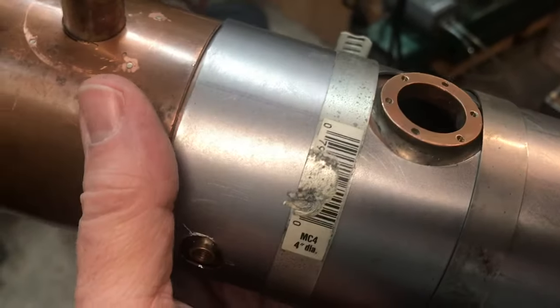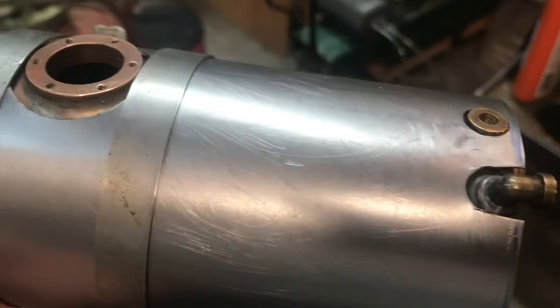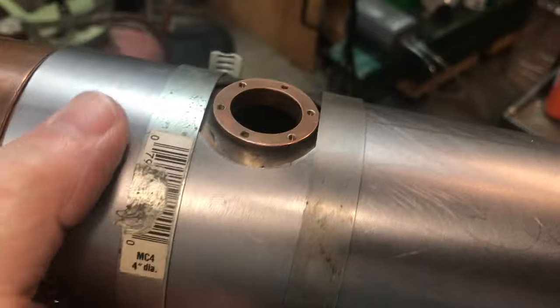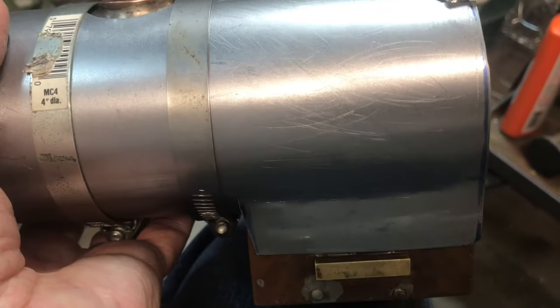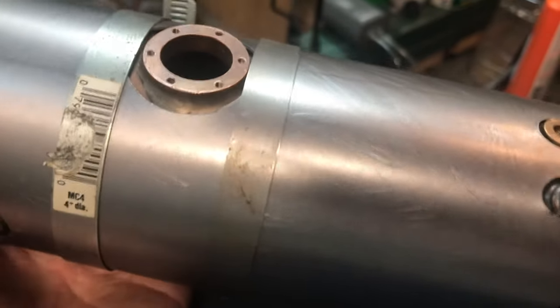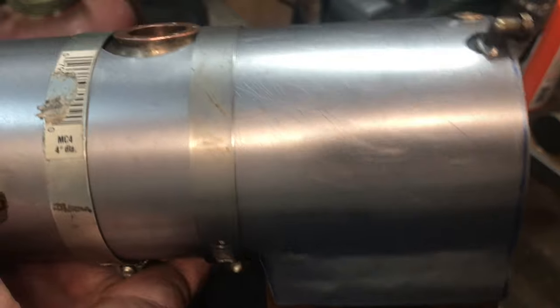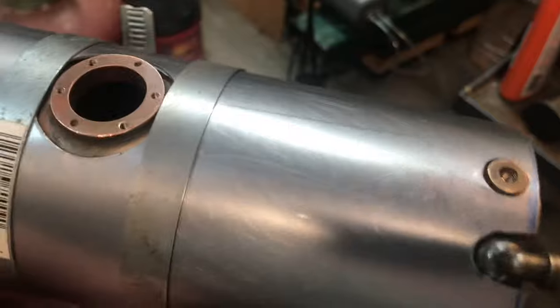The other part I realized was over here — I had made this little skirting too long, so I've trimmed that off and also trimmed some of the area under the throat plate. I think I've got it fitting really nicely now. I'm going to do some filing and sanding just to clean it up a little bit. In case you're wondering, I'm planning on putting some strips of brass in between the copper boiler and the steel jacket — just a couple strips of brass to go around and provide a little separation between the boiler and the jacket.